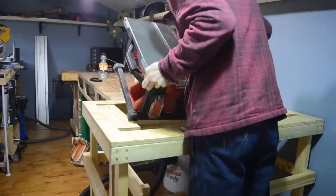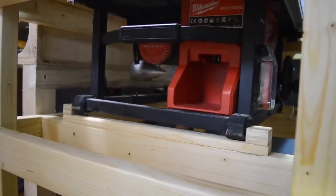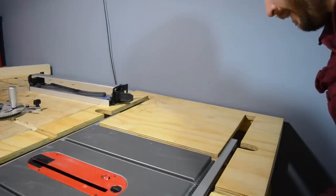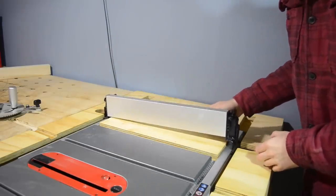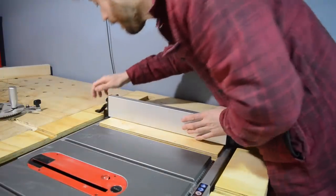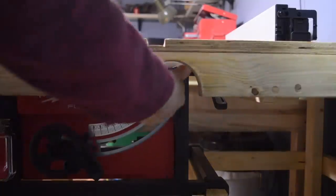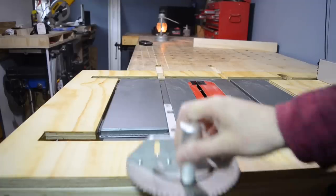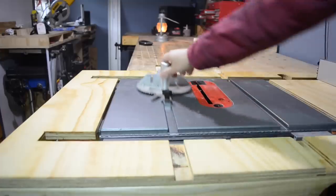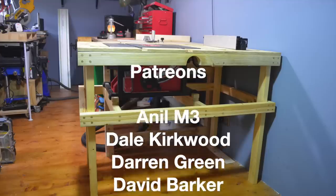Time to see how it all works. The saw just slots into place and with those blocks of wood I put in to locate it, it will stop it moving forward or backward, so I can remove the saw if I want to work outside and each time get it back in the same position. With the fence on and off you just move the rails so the pin is by those little slots, then the fence hooks into place and you can get the catches on through those little slits I cut. To move the fence this little cutout makes it much easier to reach in. This is not the standard mitre gauge but it fits in nicely for those little routed-out bits, and I also routed out some space in the outfeed table as well. So that's it all done — thanks for watching, thanks to my Patreons, and please subscribe for more videos.